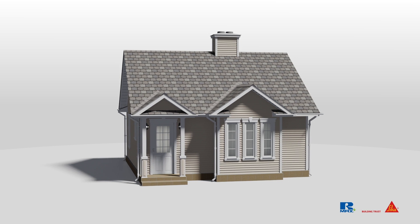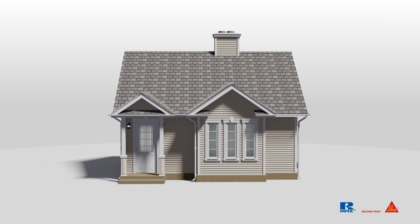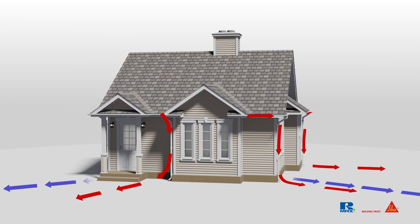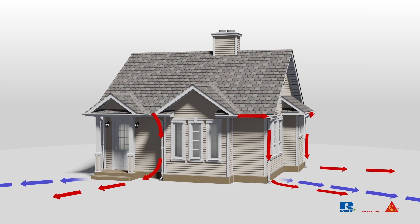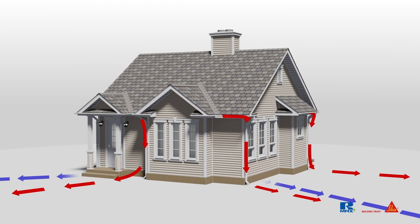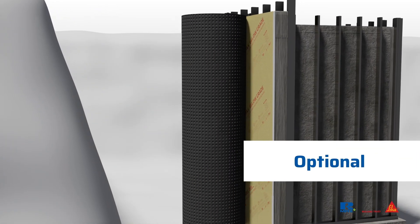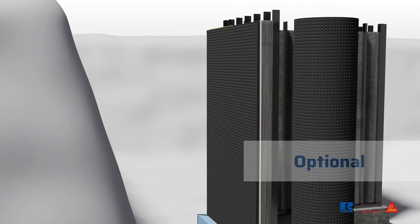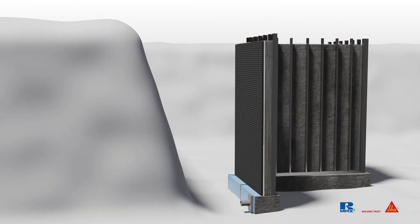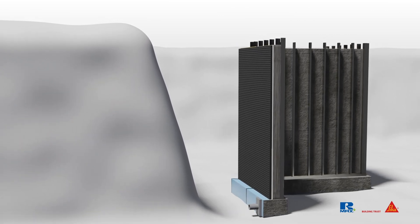Here are some helpful hints to keep in mind when designing and installing below-grade insulation. Start with a building design that includes building and site drainage — this will reduce structural loads on the building, hydrostatic pressure on the insulation, and the risk of water leakage into the below-grade spaces. To aid in drainage, provide a drainage mat between the soil and the insulation. To reduce labor costs and board joints, order the insulation boards to match the prescribed required depth and install them vertically to eliminate horizontal joints.